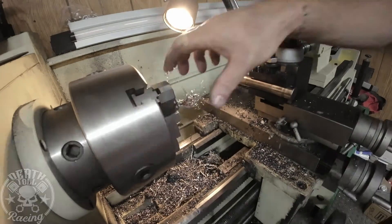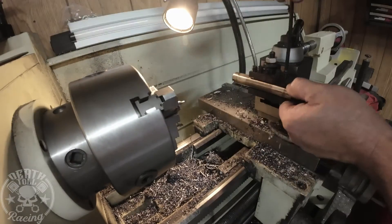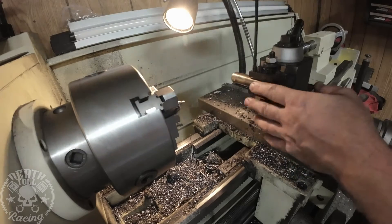As you would expect, these pins are very hard, so making those flats helps a lot. They are actually heat treated, so they're really only hard on the outside — once you get into the middle of the pin, they're pretty soft.